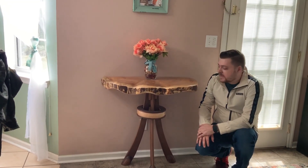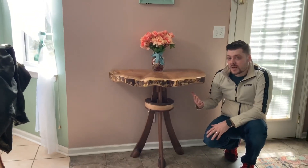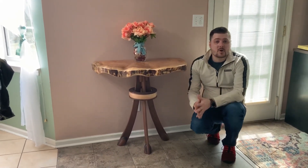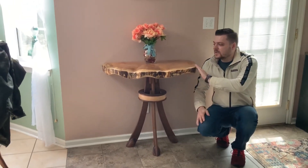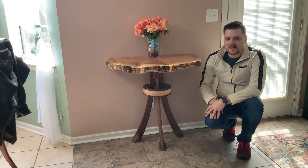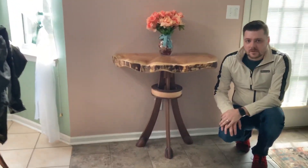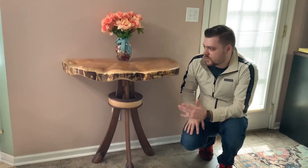This maybe took two to three hours to power carve and it was my first time power carving. It probably would have gone quicker if I were more confident. One big thing I want to point out: this table has a solid swooping shape without deep grooves, which makes sanding very easy — something you want to think about. Power carving doesn't take long; sanding does. This was end grain since it's a cookie piece, which takes a bit longer, but I got a really smooth finish because there weren't very deep grooves.